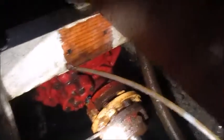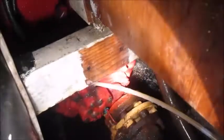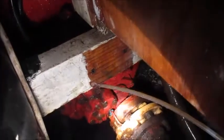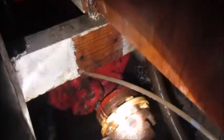So this is why we're actually chopping it off, because that one's going to snap off. So we have to chop off four of the flange bolts, the four connecting bolts to the gearbox. And we have to cut a slice in the top of the prop coupler to wedge it open and remove it. So that is the task for the day.